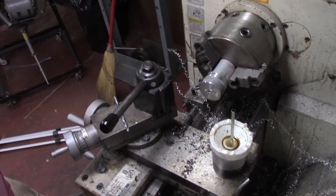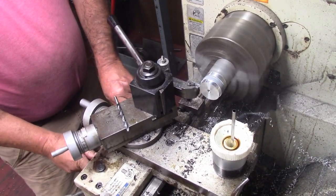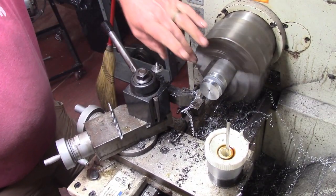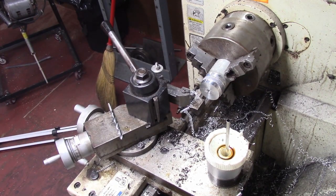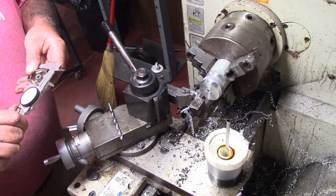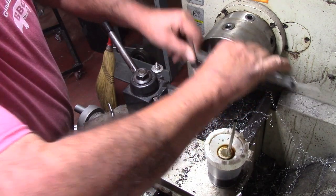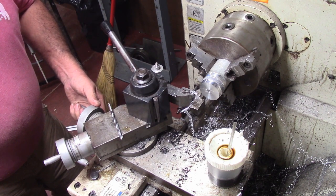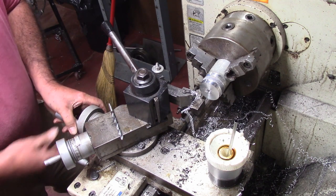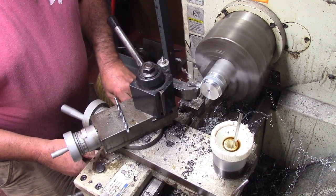Alright, let me set up for machining now. I'll do the first OD cut for you right quick. We're going to turn this down here to roughly the same dimension. This is going to be a caliper dimension — it's going to be about 1.400 inches. So we've probably got 370 thousandths to go. We'll go ahead and take some passes here. I'll take another right here on camera and bring you back when I get to this end.